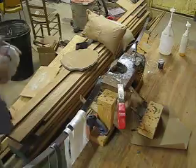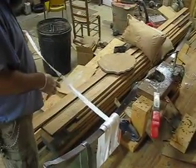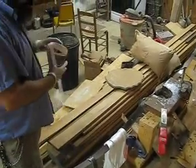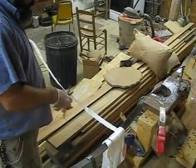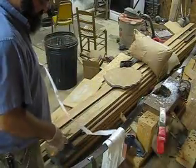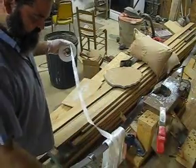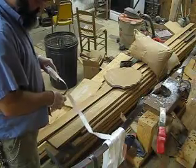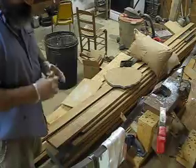There's less ends to deal with, and you'll find that the ends will unravel a little bit. But I'll normally cut 10, 12, maybe 14. It doesn't really matter, because what I don't use on this one, I'll use on the next socket. But the last thing I want to do is get halfway through a socket or almost finished with a socket and run out of fiberglass, and I have to take my gloves off to use the scissors, or get scissors covered up with resin.